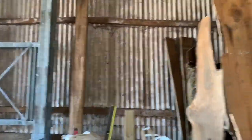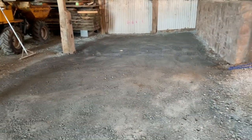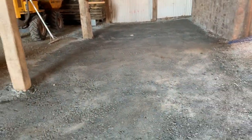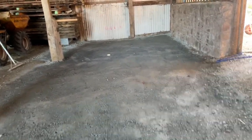I'm going to put some material flat on the top rack when I get the new arms next week. The first attempt at the barn floor wasn't particularly meant to be dead level — the barn just isn't level — but it just needs to be good enough for the machine to run on. It needs to dry out; it's very dark right now because there's no sun in here, but it should dry to a light gray. It was a fairly deep pour done in three or four layers. I'm trying to hire a roller from one of the farmer's sons to give it a real pounding.